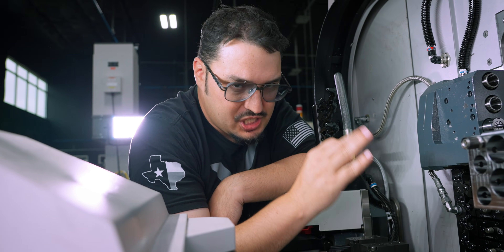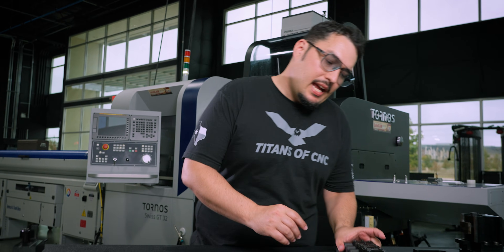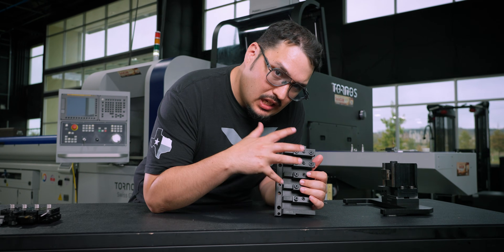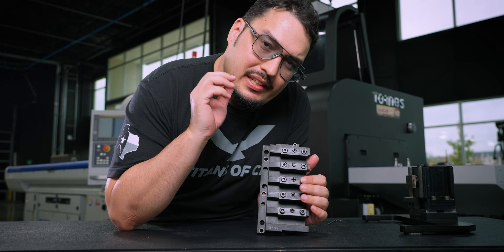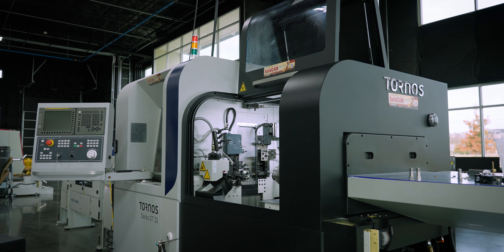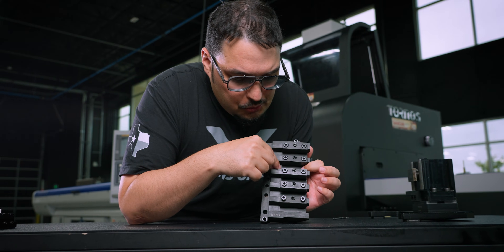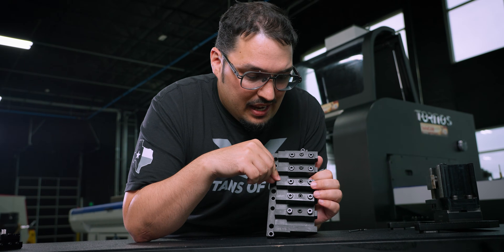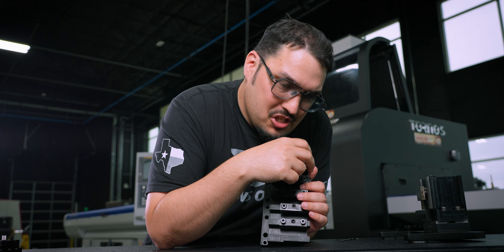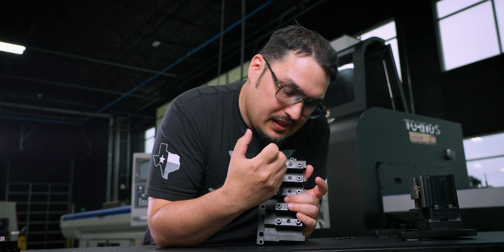The tool repeats almost perfectly each time. One of the cool things about this system is that it actually is a one-for-one replacement with the blocks that already come with the machine. Now, anybody that's used one of these wedge systems — and I'm familiar with them on the Tornos and the lathes that I used to run — when you put tools into these and run them, after a while they get stuck inside of the machine.